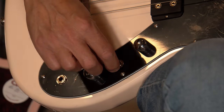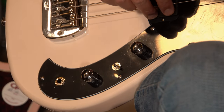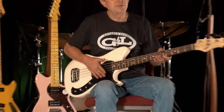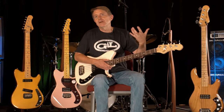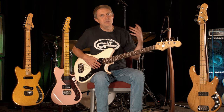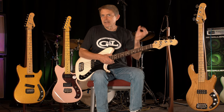Now the Fallout Bass has a volume and treble, but no bass control like this one does. But otherwise it's doing the same thing, and we have the same switch here that does parallel, single, or what people know as the OMG mode, which is series humbucking with a low-pass filter across one of the coils. So it's kind of like you get the bigger sound of the full humbucker in series mode, but just the clarity of the highs from one of the coils.